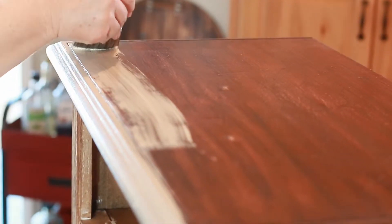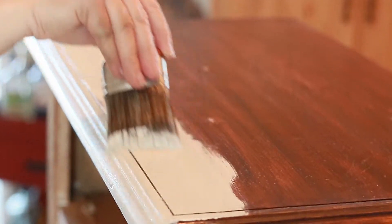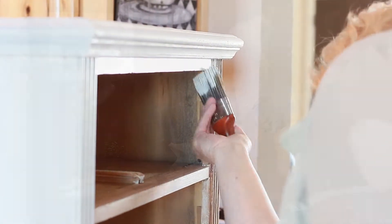When you paint with the chalk type paint, it goes on really fast and it dries really fast also. When applying the chalk paint, make sure that you take your brush from one end to the other in one long stroke — that way it will come out a nice clean finish — and be sure to clean up those drops or any mistakes right away, otherwise they will dry in there. I try not to do the short little stabby strokes, but on occasion you do have to get up in there with your paint brush into those crevices, and once you are finished getting the paint inside those crevices, make sure you drag that out right away.